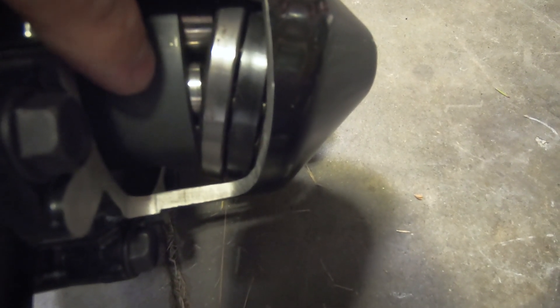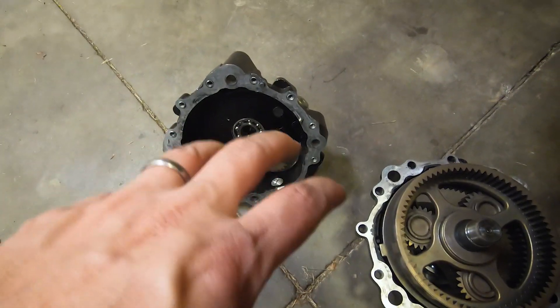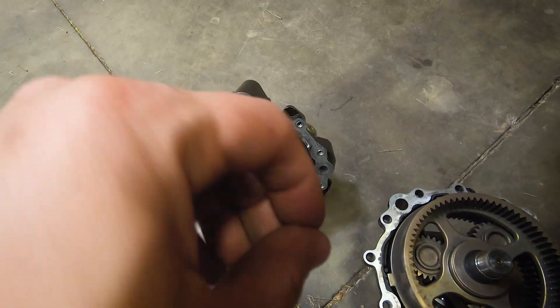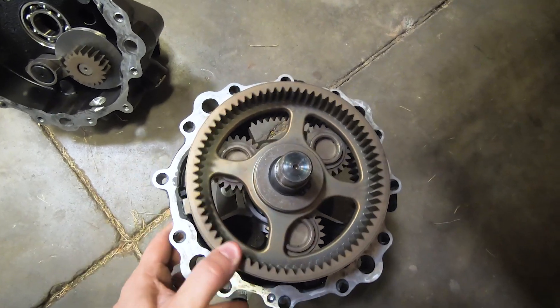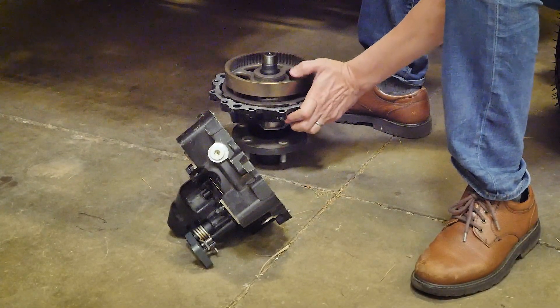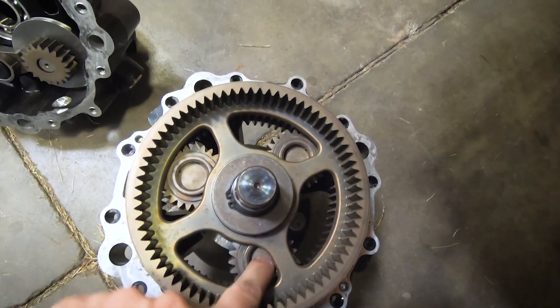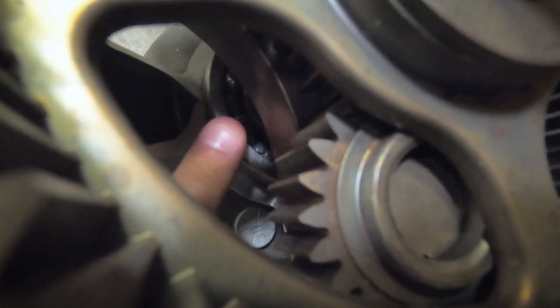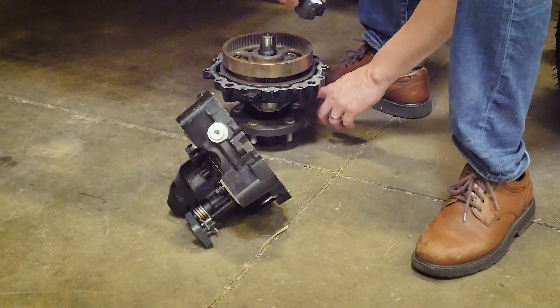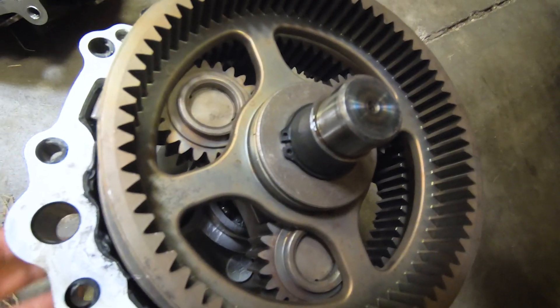This spins around 3,000 RPM, so it's a high-speed motor that has a gear reduction in it, and this makes the machine very responsive at low speed — so going around a mulch bed, tree, or fence post gives you a lot of response and very good accuracy in the controls. That little gear spins around 3,000 RPM and spins this ring gear; when this internal ring gear spins it drives this planetary reduction — planets, a ring, and a sun — that drives the axle. We get a really good gear reduction giving us torque and sensitivity, and it also has a very large ball bearing, whereas typical roller motors have a very short needle bearing. We have a heavy-duty ball bearing and a very large axle that helps with offset axle loads with big tires or duals.